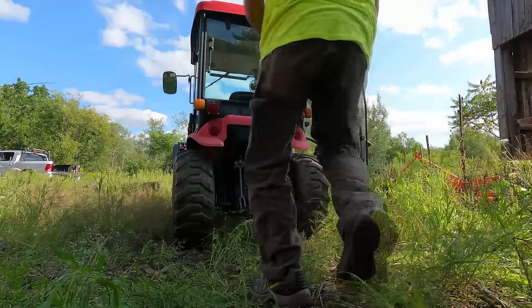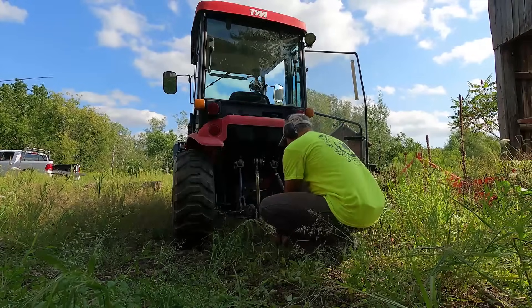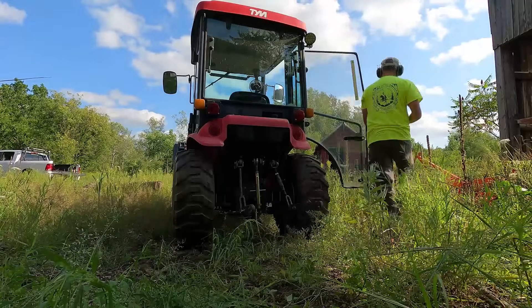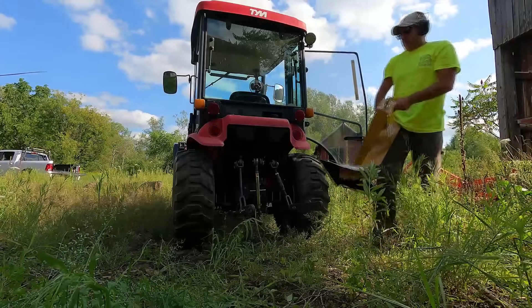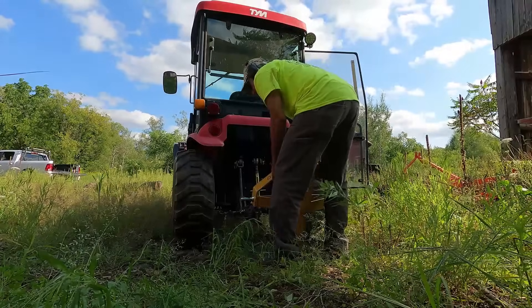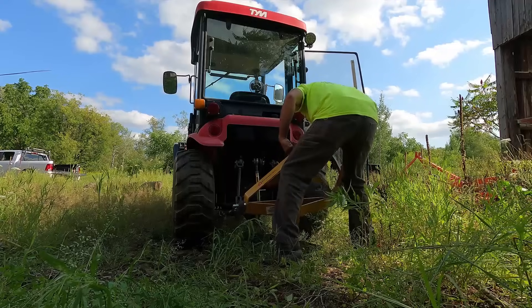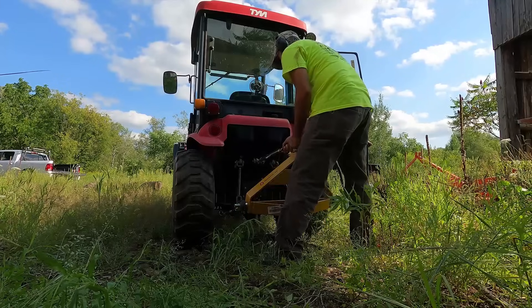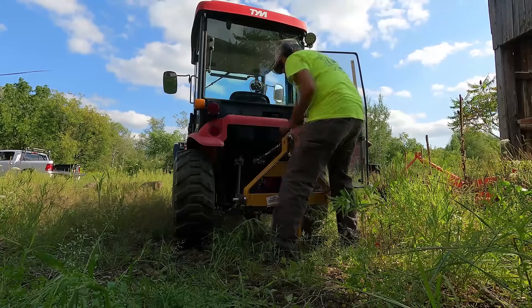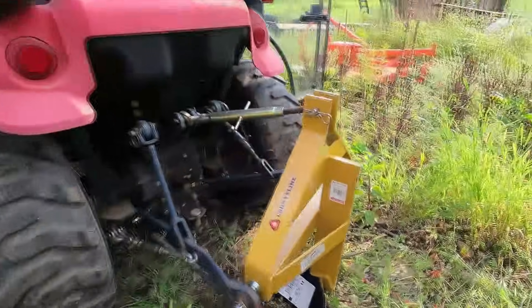However, when I did get it back, everything worked fine. The input shaft was fixed, the coolant was fixed, everything was good to go. So the first thing I wanted to do was try and plow the planting field, or basically any area on the farm, because as you can see this grass and weeds has overtaken my entire property. So I bought this one-bottom plow attachment for compact and subcompact tractors from Tractor Supply. While it's shiny and new, the advertised feature was that this thing would plunge down into the ground about 14 inches. All you have to do is hook up the top link, adjust it so that the plow is essentially horizontal to the ground, and everything was supposed to work.